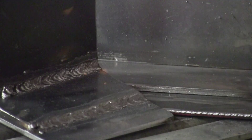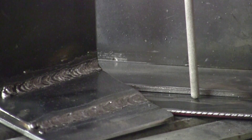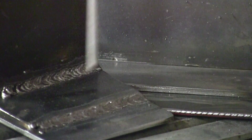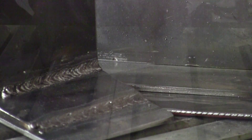Now the fillet weld is different than the butt weld, because with the butt weld you've got the bevel on both sides and you're filling in the groove. Here, you've got the flat angle piece and the right angle piece. I've got my T-weld and my lap weld. They're both actually a fillet weld, but you can see the difference in how they look. And that's our fillet welds right there.